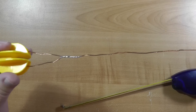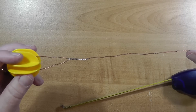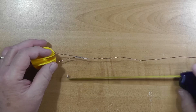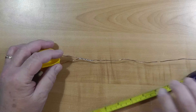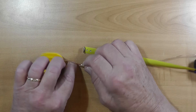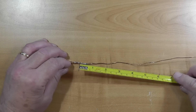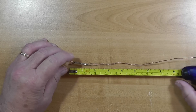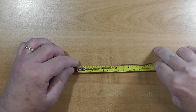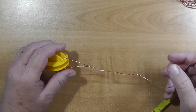What we want to do is shorten this antenna by six inches without cutting anything, without making it impossible to go back, and in a way that we know will work. So let's suppose that we've decided we need to shorten this end of the antenna by six inches. We're going to use as a point of reference the place where the wires come together, right there. That'll be our point of reference, and we want to take six inches off of that. Six inches puts us right there. I'm going to put just a little turn in the wire, just to remind me of what we want to do.